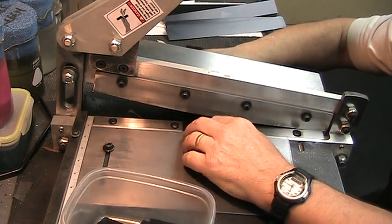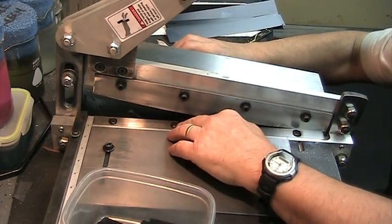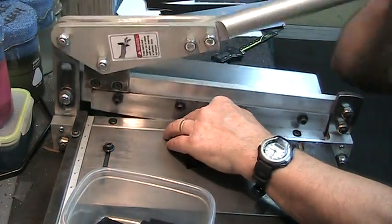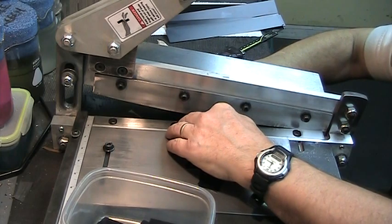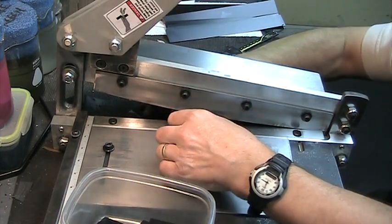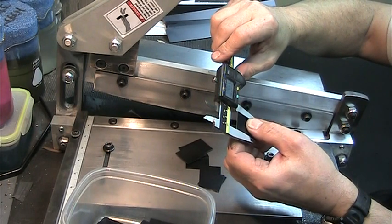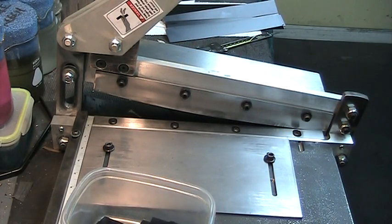Now we set up for the other direction. These are 10-inch sheared strips and I've designed it so that they yield exactly nine pieces at the 1.111-inch dimension. Depending on how close the 10-inch strip was and how accurate my setting is, I also flip the piece each time to not accumulate an angle. We measure the last piece — it tells us how close we are, within four thousandths. Plenty accurate enough for a heat sink.